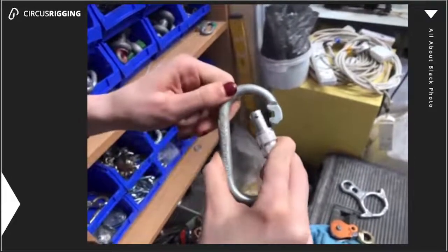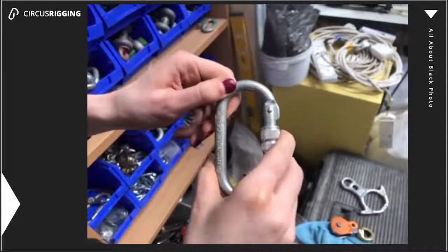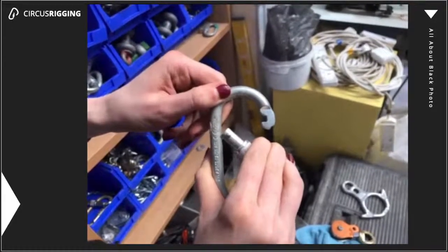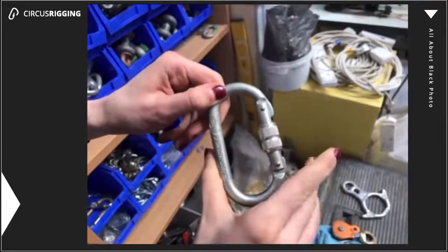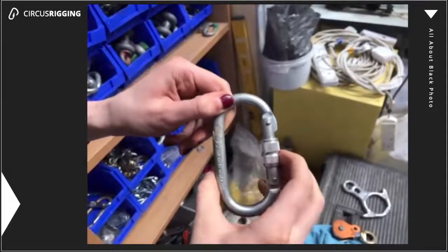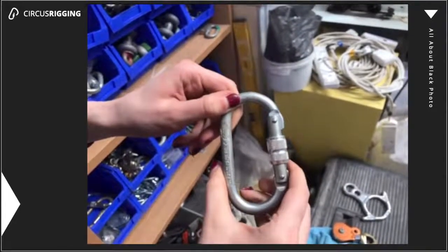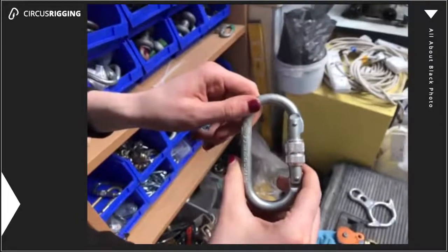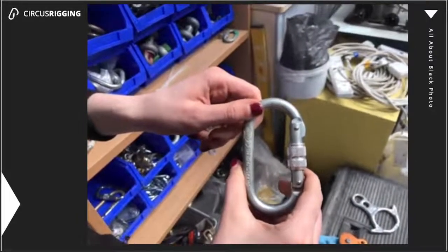And that tells me, does it open right the way back? Does it feel stiffer the further back you go? And then let it go with a sharp snap. Yeah, so it doesn't look as if there's any problem with the spring. As they get older and weaker, the spring tends to wear, and that closing action won't be as good.